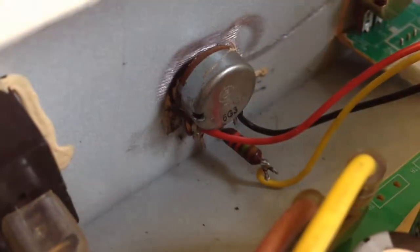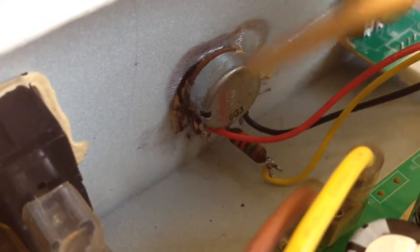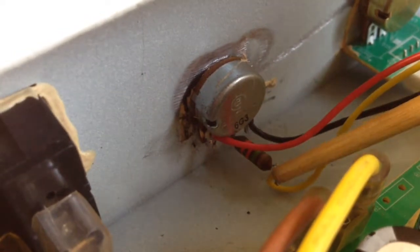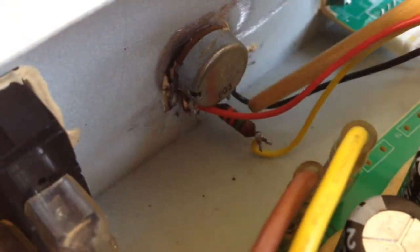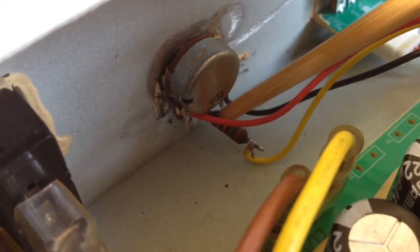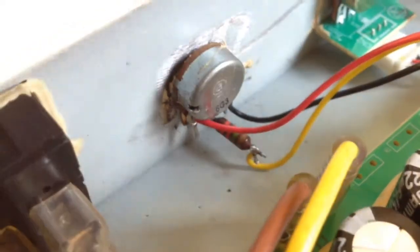This is what's going on in the chassis. This is the master volume control - I've got my obligatory chopstick master volume control. There's a resistor to keep some resistance between this and the output tube, but it's only 1.5k. The problem always arises when I max this master volume, so I'm going to put in a higher resistance here.